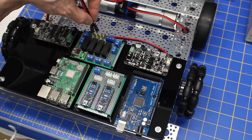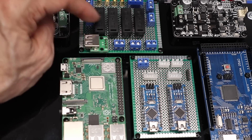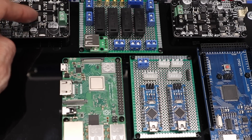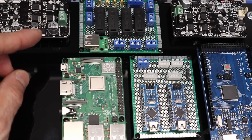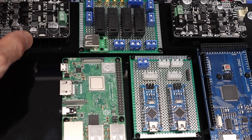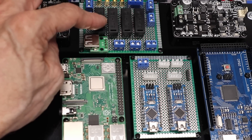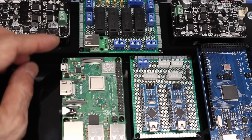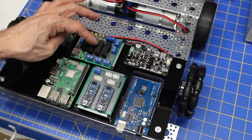The power distribution board has some pins at the top where I can plug in the motors directly. It's also got four fuses — these two fuses are for the motors themselves. My motor controllers are capable of supplying enough current to reach the stall current of the motor, which is not necessarily a good situation. To avoid a catastrophic incident where the motors are stalled and drawing incredible current from the batteries, I've got two fuses on the motor lines. I've also got a fuse on the 12-volt and 5-volt lines, and I'm going to keep this practice up on the other layers of the robot as well.